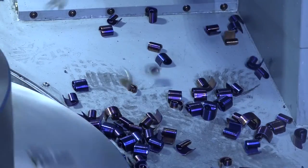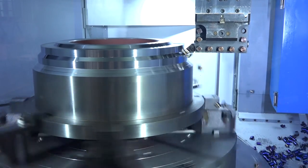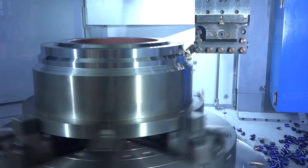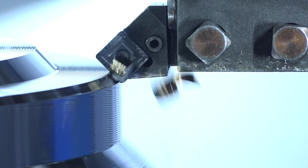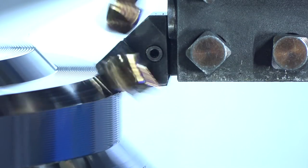How big does this table go? Up to five meters. What sort of weight could you put on this table? This particular model can take up to 30 tonnes. If you're putting 30 tonnes on this table you need a lot of power — it starts at 45 kilowatts going up to 105 kilowatts. So you can really remove metal — it doesn't matter whether you're machining cast iron or titanium, it goes across the board.